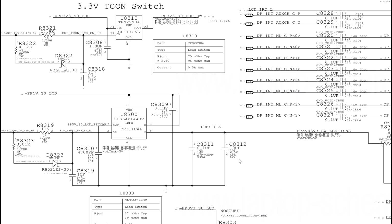You know what? I have to put the inductor back on anyway, so I might as well put it back on and then plug it in, and then do my OWI test. I'll probably use alcohol instead, because I'm not in the mood for OWI today, but let's check it out. So I'm going to grab my tweezers, put my inductor in that area, grab my hot tweezers, and make sure it's flat on the board.